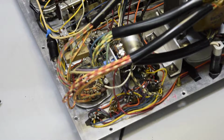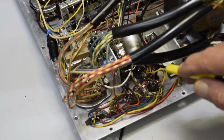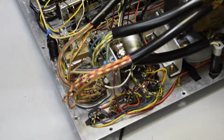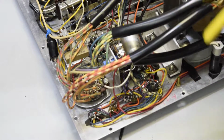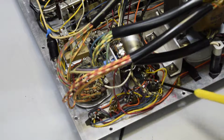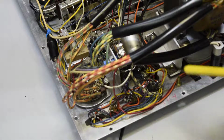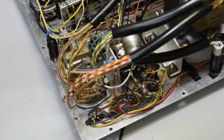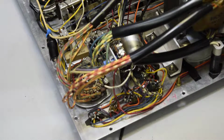Yeah, I'm back. I managed to change the 7-pin socket, the 9-pin socket, and the octal socket. I wasn't having any trouble getting it to test the tubes, but the 9-pin felt kind of loose, so I changed those three because those are the most common ones. These other tube sockets hardly ever go bad.